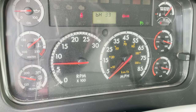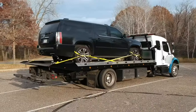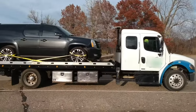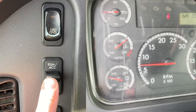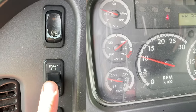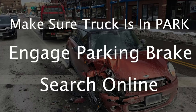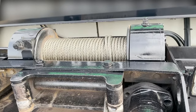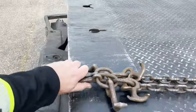After you've turned the pump on, now you can idle up. To idle up on your truck — it may be a little different from mine — but most are connected to the cruise control system in some way or another. The most common way is to turn your cruise control on, press the resume speed button once, then press it again and hold it the second time. The idle should be around 1000 RPM and most definitely not exceed 1200 RPM. Now that you've got the hydraulics rolling, winch out a little bit to let some slack on the winch line — just enough to unhook the bridle from the end of the bed.